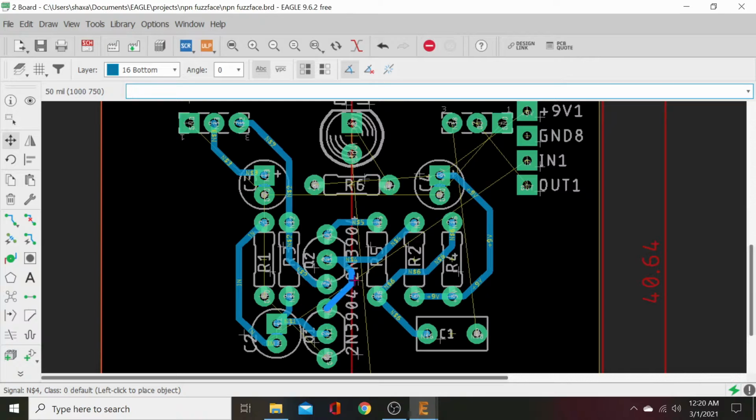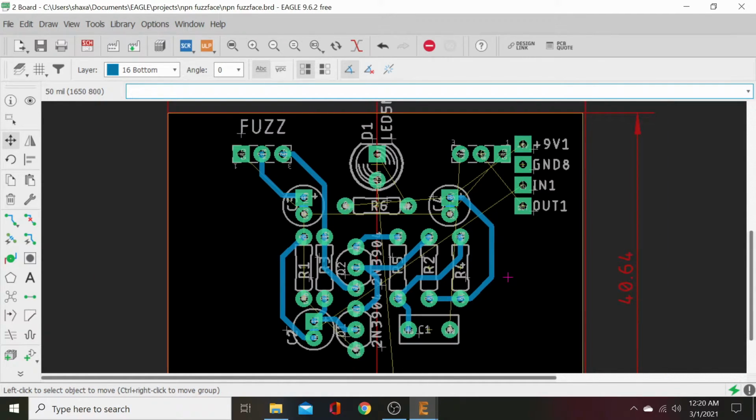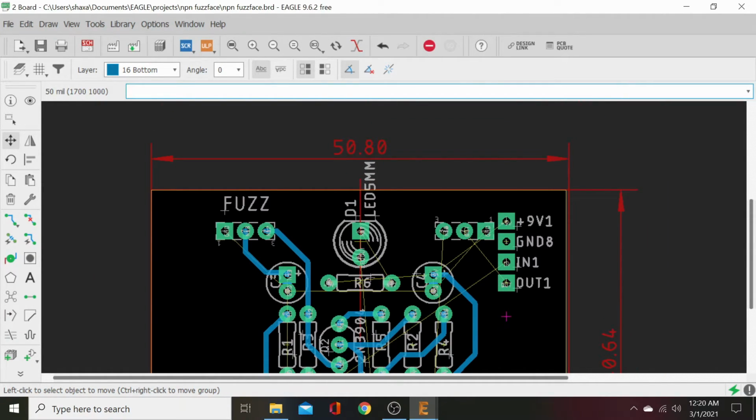This can be angled now. All these angles look great. Clearances look great. Let's move this cap over a bit. Let's line the edge of it up, at least with the edge of the capacitors, and that with the edge of these parts. So there's no odd spaces that look weird. That's fine right there. All right, now to our pads.